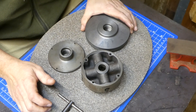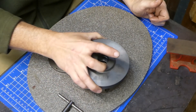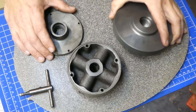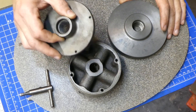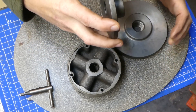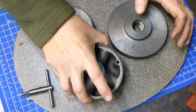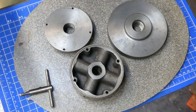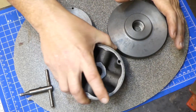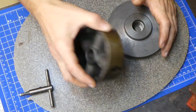But I told him: if you want, what I'll do is buy an adapter plate for a 1-10 and adapt it on there and sell it back to you for the same price. Now, it really should be done on the machine it's going to go onto, because you can do all the machining with it screwed onto the spindle. He just wasn't comfortable doing that. And because it's a 4-jaw chuck, it doesn't have to be as perfect as a 3-jaw - the jaws are independent and you're going to center up your part with an indicator anyway, not just throwing it in and expecting the jaws to center the part.